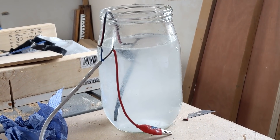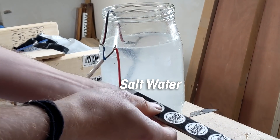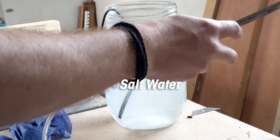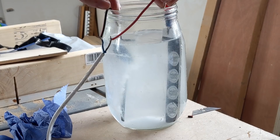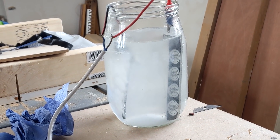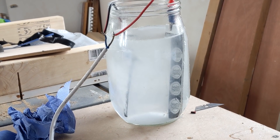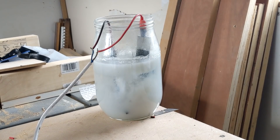When it comes to etching, all you really need is a glass jar, a 12V power supply and some crocodile clips. I have the negative terminal connected to a bolt and the positive onto the piece. I left it in for about an hour — play it by ear. If you leave it in too long, it undercuts the mask and you lose all the definition. It's worth pointing out that the gases that come off this are not particularly nice, so keep it in a well ventilated area.